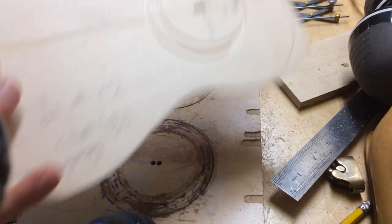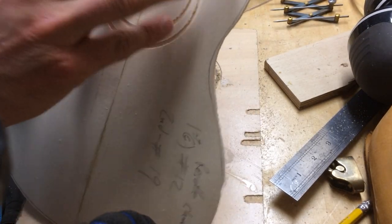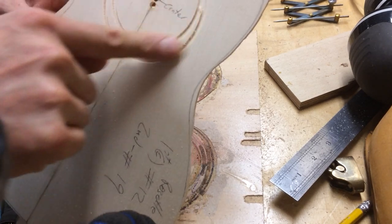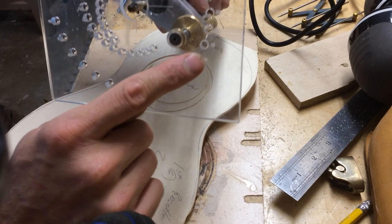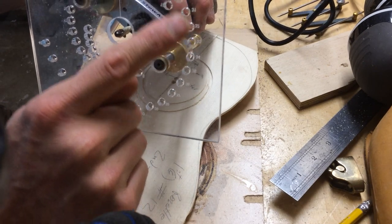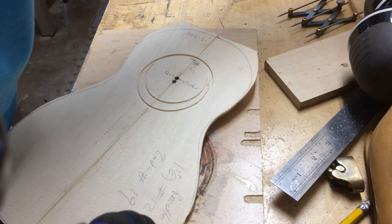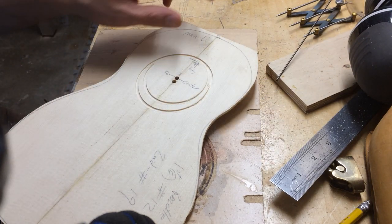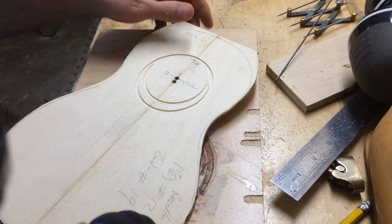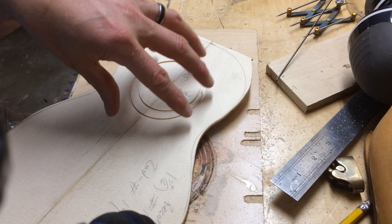Using these numbers, I can cut the insert exactly to this shape. Each hole is 1/16th different, and 1/16th is about 60 thousandths, which is what a reasonably typical black-white-black purfling is. So you just figure out what numbers you need to use and then make the insert.